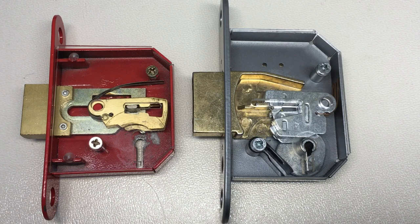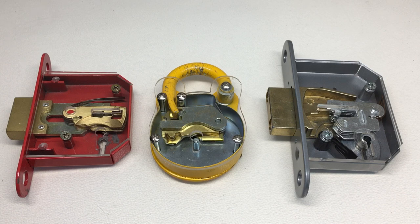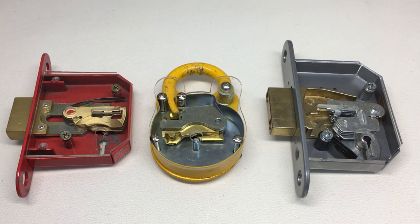You'll also notice that this lock actually has false notches — some fake notches which act a bit like the gating and can engage with the bolt stump and trap it if the levers are not lifted to the correct height. Another feature of this particular lock is that the belly of the levers are so low that they are even touching the curtain, which makes putting a lever pick underneath it extremely difficult. So hopefully now we know a little bit more about the terminology and types of lever locks. In my upcoming videos in this series we'll be talking about picking techniques for non-curtained lever locks, lever padlocks, curtain lever locks, and some advanced picking skills as well. Thanks for watching and I'll see you for the next part!